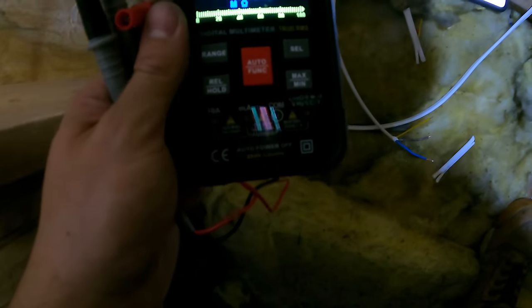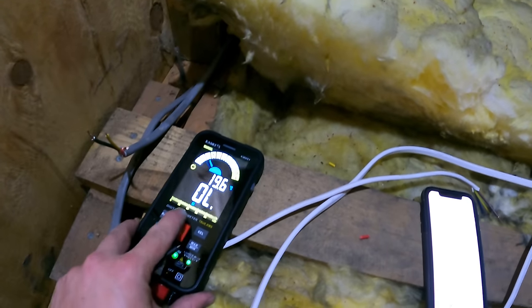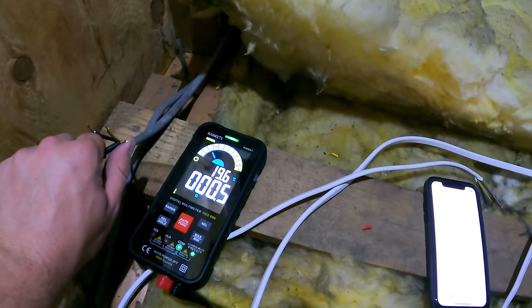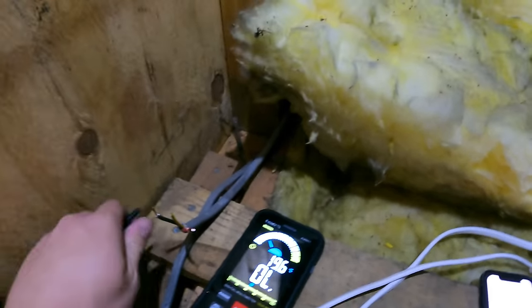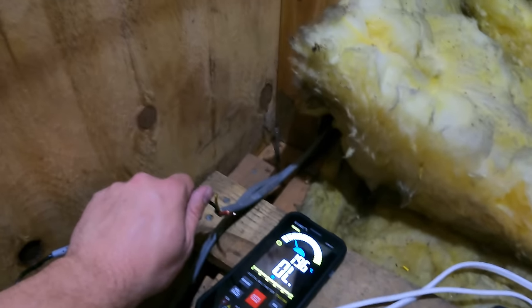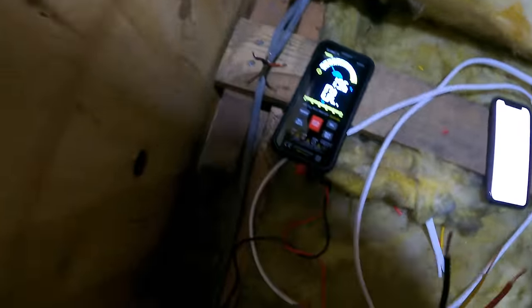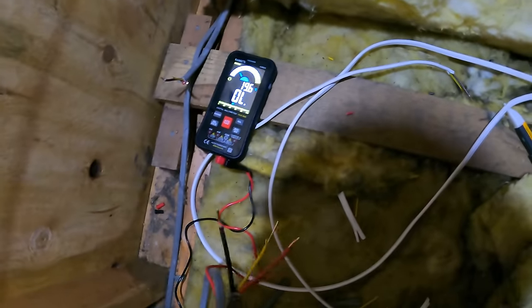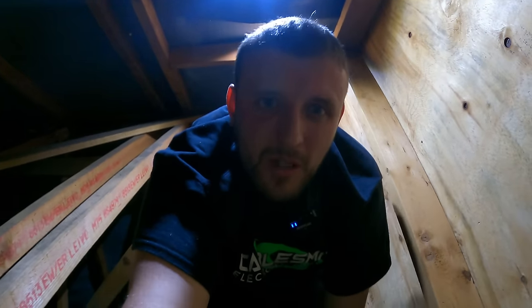Check it on a socket properly. What's good is it tells you which ports of the four to plug your test leads in for the specific test selected. Getting continuity there. The bell test is obviously good for belling out cables - it's handy to have in your bag. Live, earth, neutral - belling out the neutral there. Because it's so cheap I'll stick a link in the description. The non-contact voltage thing is not bad - worth having in your bag. It's a handy little device and looks quite cool.